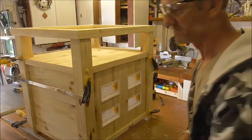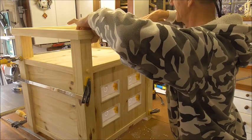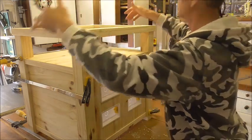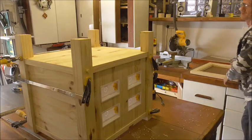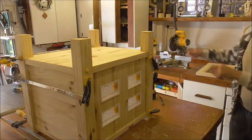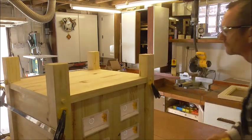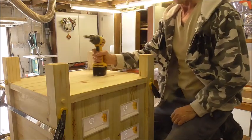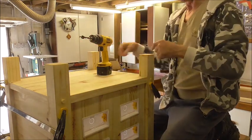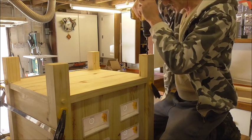The next part is putting on the frame for the top, which we need to be quite careful in its positioning. That is just formation — the corners that will go when I clamp it in. So what I'll do is drill first in the top where I want the dowels to be in the mitres. Here's the same dowel setup as before — I'm going to go in the outer diagonal corners so it will give me either side of the mitres, just coming in 20mm.